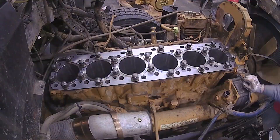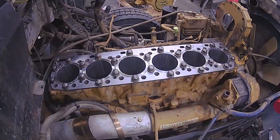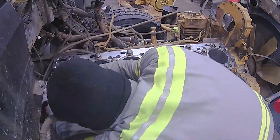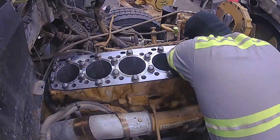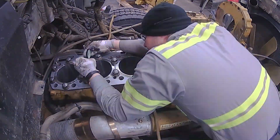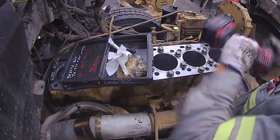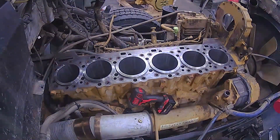Then we're going to install these — they're basically very short cylinder head bolts, actually track bolts, and they have two special washers: one is brass and one is a fiberglass composite. I use a little drill impact that puts almost no torque out, and then I actually torque these to around 40 foot-pounds. The CAT spec is actually 70 foot-pounds, but I've found that doing 70 tends to split the fiberglass washer, and I've seen no difference — all you're really doing is holding down the liner.